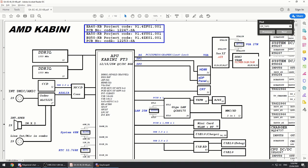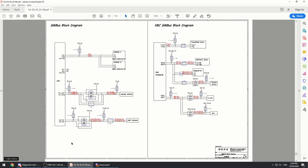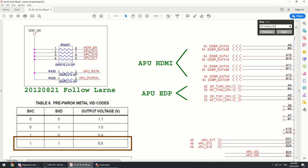HDMI and display panel seem to be tied together. I scoped the HDMI port and there were no signals there either. I was looking at this power block diagram showing the flow through all the regulators, and had a thought: what if this needs to know there's a screen attached in order to make an image? So I plugged in an HDMI monitor and got an image. That might go back to my theory about the HDMI enable signal coming from the 1.8 volt rail.